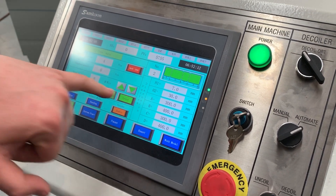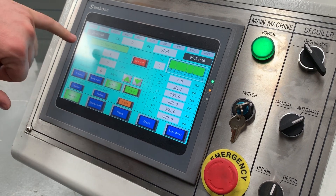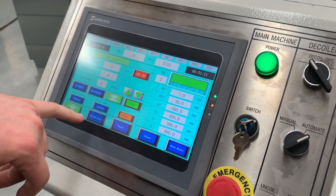We can set up the sizing we want to run through — at the moment we'll do a 300 by 400 duct. We set the quantities we want to produce and this can all be saved. When we want to start, we can just hit start and it's going to run through that by itself.